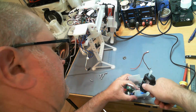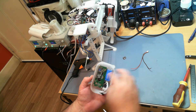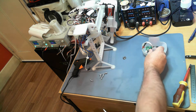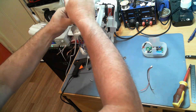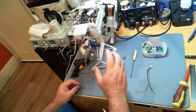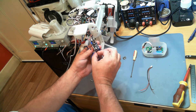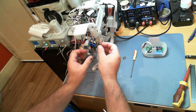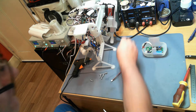While that's warming up let's start pulling the back off. When I was soldering and connecting this all up, I made sure that the black wire is connected to the negative side of the capacitor and the red wire connects to the positive side. If you're going to do this, make sure you check that polarity — it is important and it's very easy to blow it up if you don't. The two switch-mode power supplies in here: one is tuned to 6 volts, one is tuned to about 5.1 to 5.2 volts. The 5-volt one is the one that feeds the Raspberry Pi, and that's the one we need to connect these wires to in parallel with the capacitor.